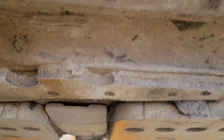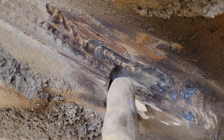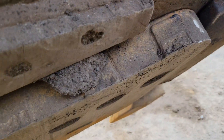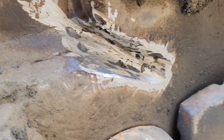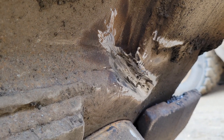This is what happens when you go chasing cracks. I got that one gouged and ground it up so you can see it keeps going up here, so it's got to be gouged out some more. Look at this one — this one looks like a little crack but ended up being a big chonker. It was cracked all the way through. I could go a little bit further but I don't really want to, so I'm just going to fill that up.